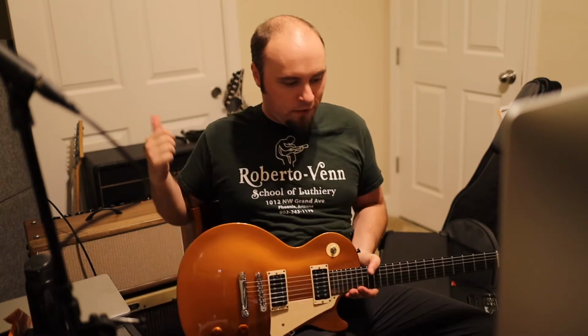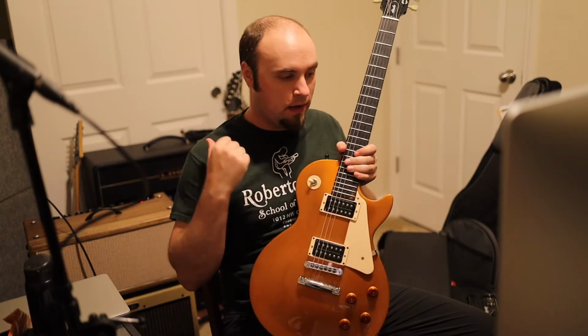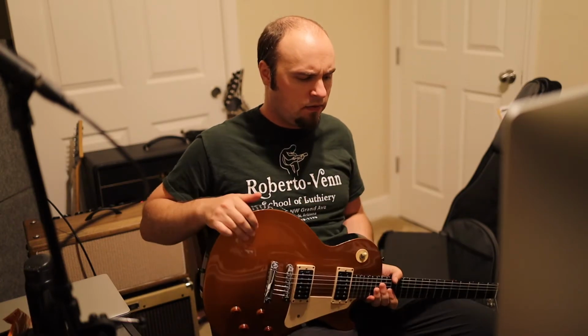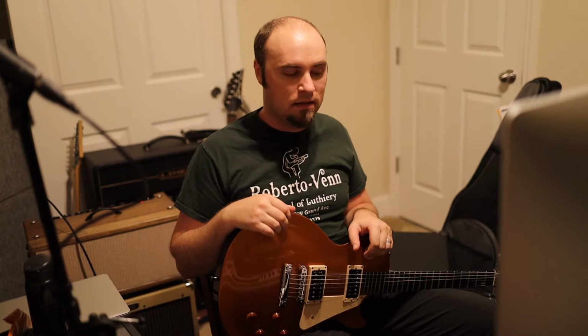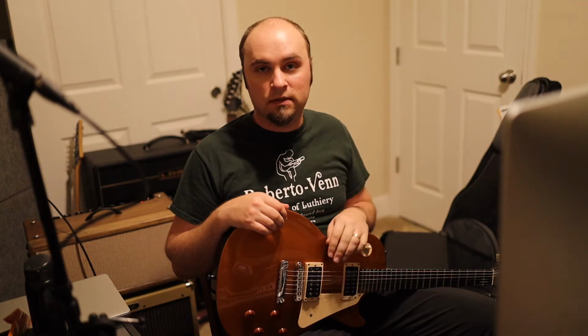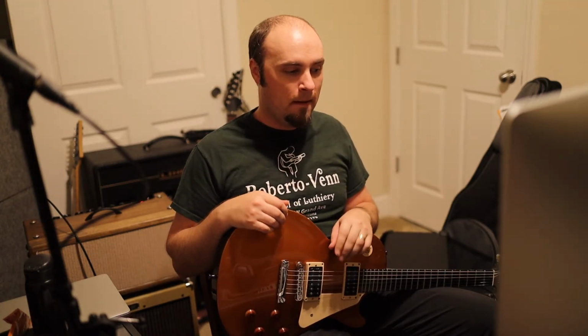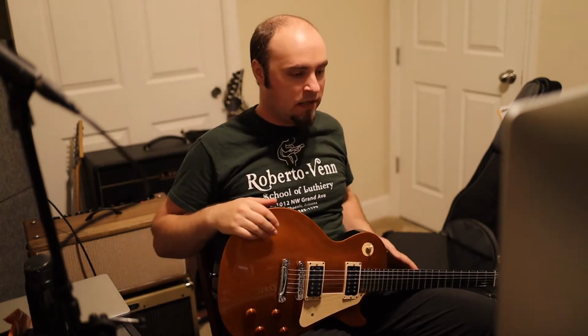So, what else? Fender started utilizing higher negative feedback circuits in their amps, and what that does is some of the current in the circuit that is supposed to go to ground, he instead looped back into the amp. So then it forces more clean sound, I guess. Negative feedback. There is a more technical part to it. I'd have to go read more books to remember exactly what it is. But basically, it makes the amp remain clean as you turn it up more.